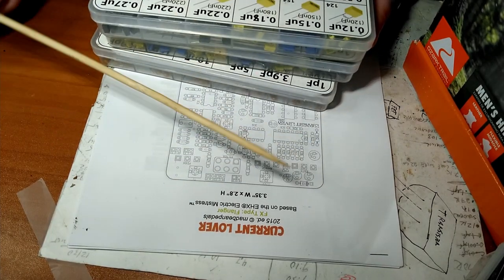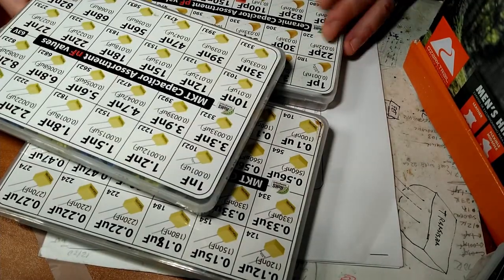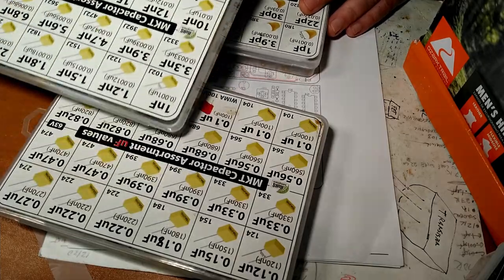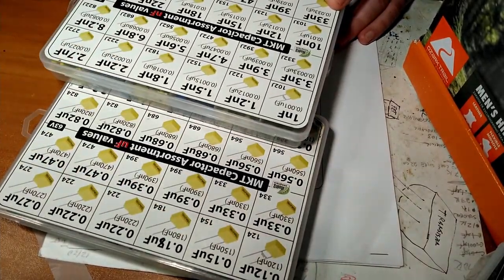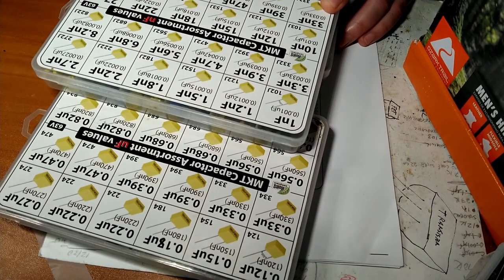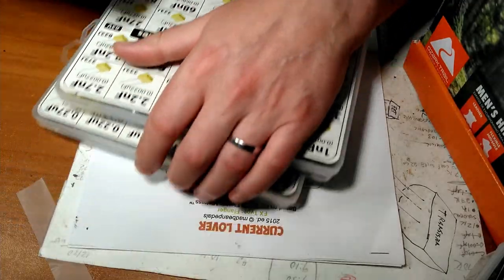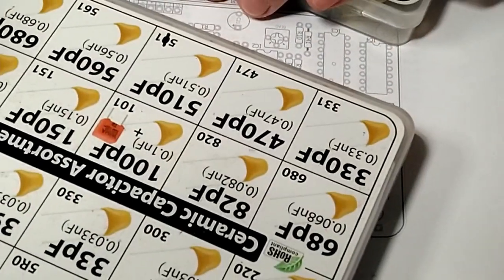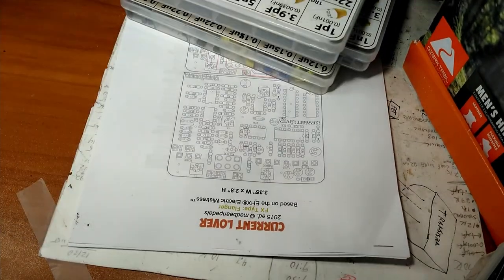the PCB makers are making their PCBs for these box capacitors, and you could basically get just about everything you need in three kits. So we get two kits of box capacitors, 120 nano all the way up to 0.82 micro. I got more stuff kicking around, but just to give you an idea. Then we got these guys, forget what they're called. Poly maybe.